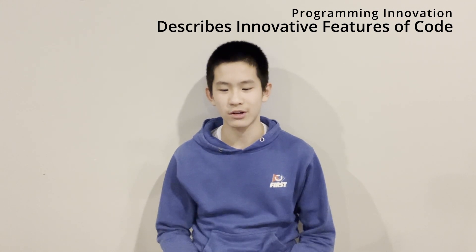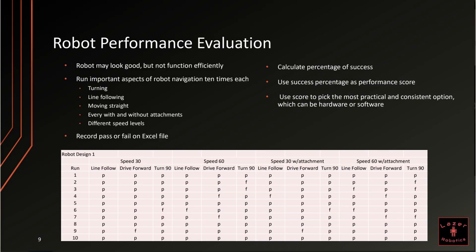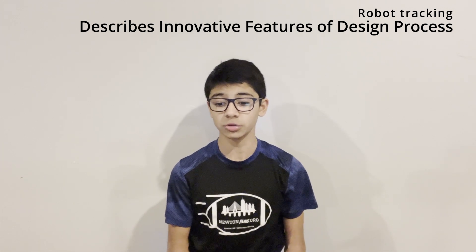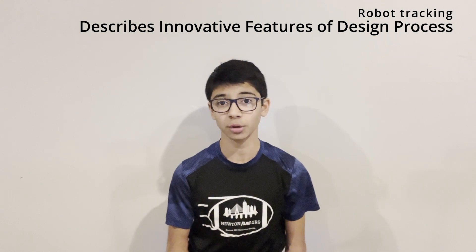Over the past five years, we have learned that our robot may look good but not function efficiently. So we run important aspects of robot navigation ten times each, which may include line following, turning, moving straight — every time with or without attachments and at different speed levels. We record pass or fail in an Excel file, calculate the percentage of success, and use that as a performance score. We use the score to pick the most practical and consistent option, whether that be hardware or software.